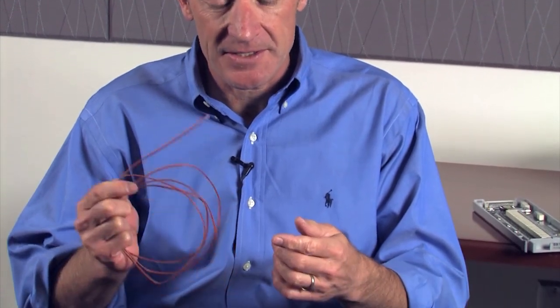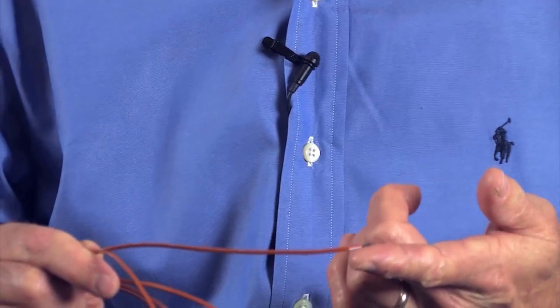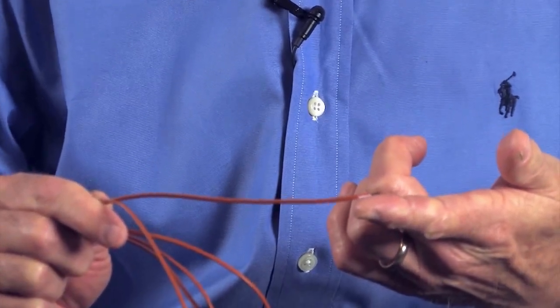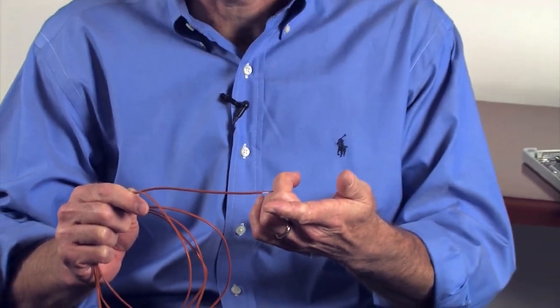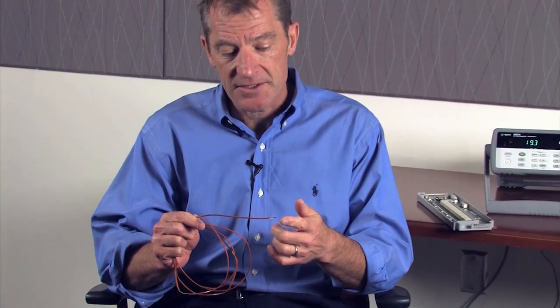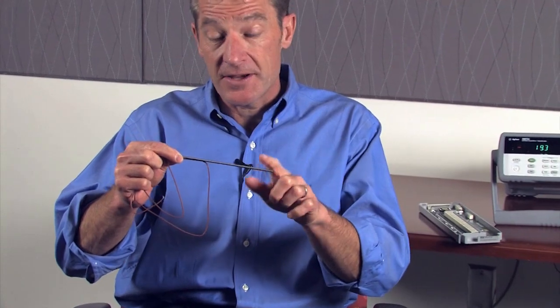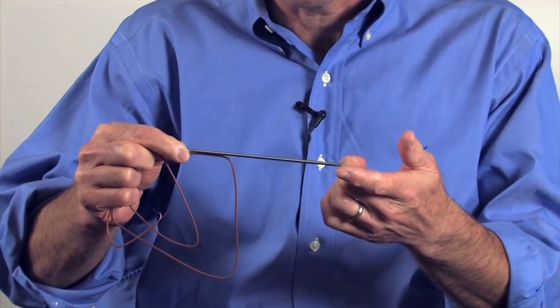Let's start at the tip with the three thermal errors. The first is adhesion — you want to make sure that your thermocouple is well adhered to the device you're measuring, because if it pops up or lifts up you're going to be measuring the air temperature above the device. The next consideration is the mass of the sensor compared to the mass of the device you're measuring. I have an insulated thermocouple with a large metal tube on it, so it has a lot of mass — this would not be very appropriate for measuring a small semiconductor device.